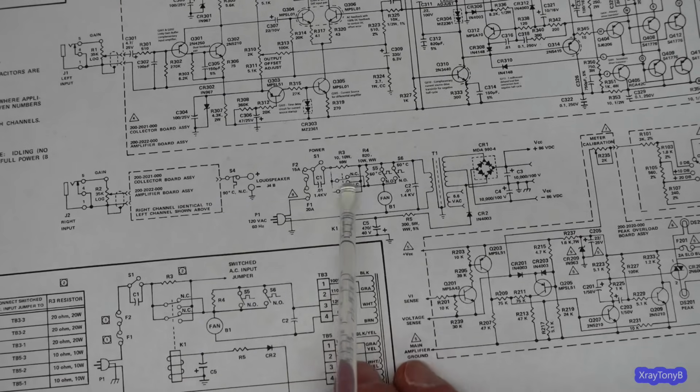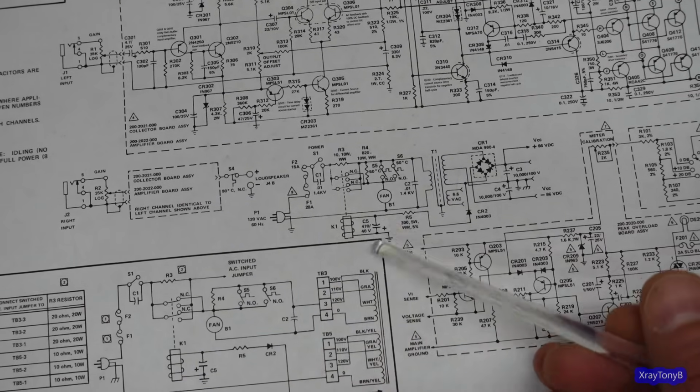The capacitor acts as a short until the voltage builds up, which will prevent current from flowing through the coil, or will minimize the current. Not enough current will flow to pull the contacts in. After the cap charges up, current will then flow through the coil at full power and the contacts pull in.